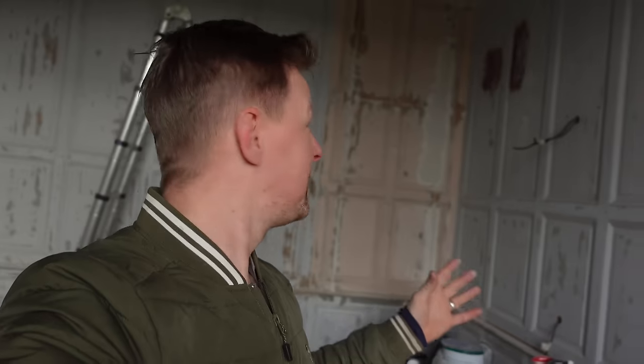It's nice and quick and easy to mix. Obviously it's a two-part wood filler, so you just mix it up. You have a golf ball size of the filler, and then you have a pea size amount of the hardener. Mix that up. You normally have about 10 minutes or so to work with it. Get that on and then leave it, and then you can just sand it all off, and once it's undercoated, you'd never know that there was about 50 different panels pieced together. So yeah, it's all good.